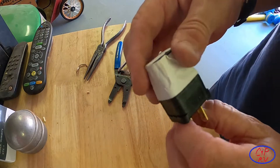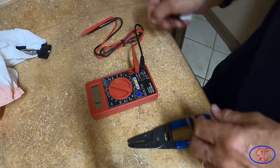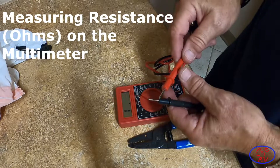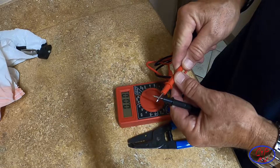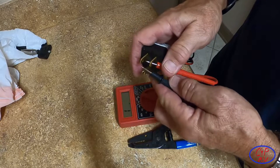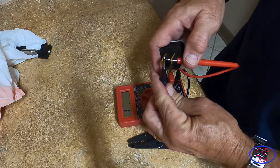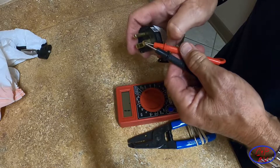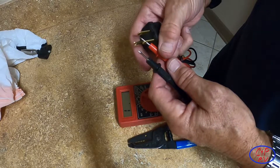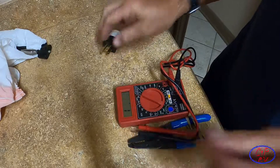Some one-inch gaffer's tape closes it up nice and clean, and it also makes it stand out as a unique piece. If you have a multimeter you can very quickly check to make sure this is right. When you close that circuit it's going to go to zero, and when it's open it's going to read one. We're going to check the neutral side against the ground post — it goes down to zero. We check it against the hot post — it stays open. We check the hot side against the ground — it stays open. So we have a closed circuit between our neutral and our ground, and that's exactly what we want.